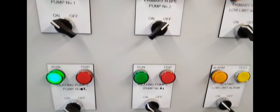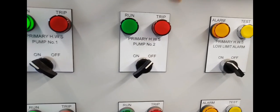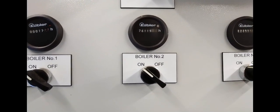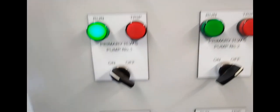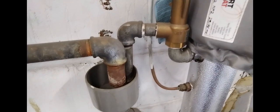This is a look at the control panel. Always remember to check before you do any servicing what the control panel is saying, if there are any warning lights on. Up here you've got some readings of how long the boilers have been running — that's a good indication of which boilers have been on.